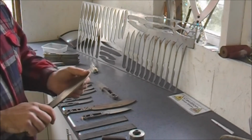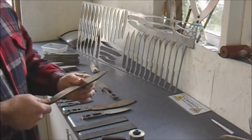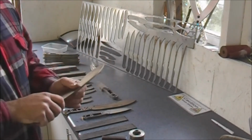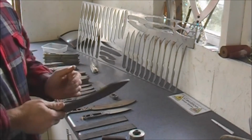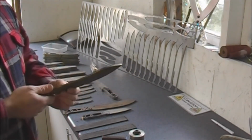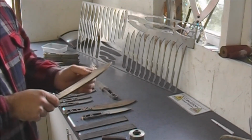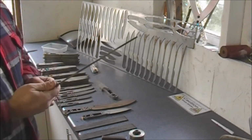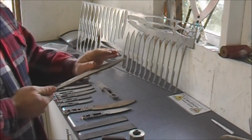You don't generally make large knives out of stainlesses because stainlesses don't have the strength and toughness available. But I've seen quite a few knives made in N690 to a reasonable size, bigger than this even, and it can be tempered back to mid-50s Rockwell, again to help with the toughness. So that's what I've done on these. They're all heat treated the same to 150 degrees, 60 Rockwell.